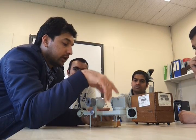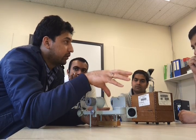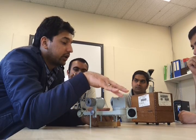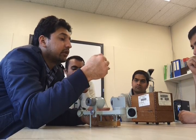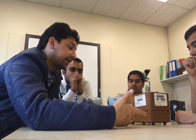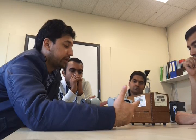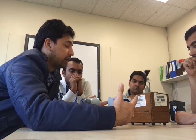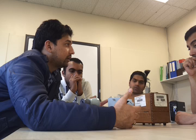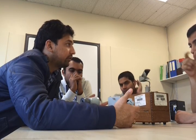Now next in line come your shade errors and what we call optical errors: shade error and prismatic error. Prismatic errors deal with when your index mirror shades and your horizon glass shades are not parallel to each other. You will have some prismatic error. And shade error will be that the horizon glasses themselves are lacking parallelism.